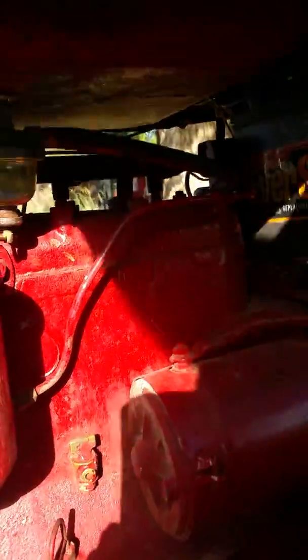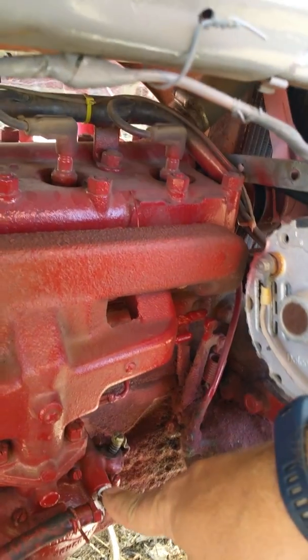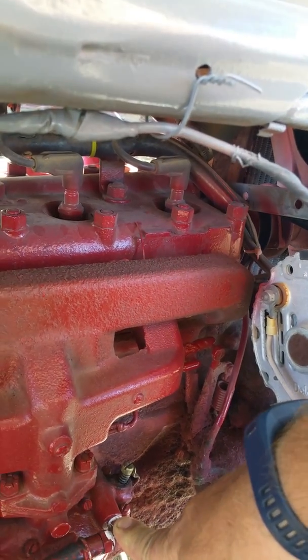And the reason is, as you will see on the other side, because it is very difficult to keep your rubber hose off of your exhaust manifold. And when you melt your rubber hose on your exhaust manifold, you get a fire. Big fire, no tractor.